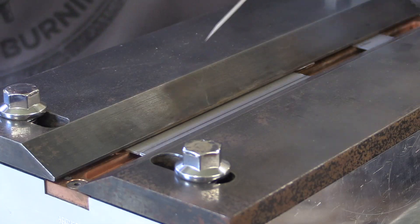All this cleaning might seem like overkill, but it is what it is with titanium. If you don't clean it, if you don't take that extra care — especially cleaning that sheared edge, wiping it down with acetone before you do anything, and a final wipe before putting it in the fixture — you wind up with something like this. This is a typical X-ray negative of a titanium joint that was not cleaned properly. Porosity is very common in titanium and it's very common on the 2G test.